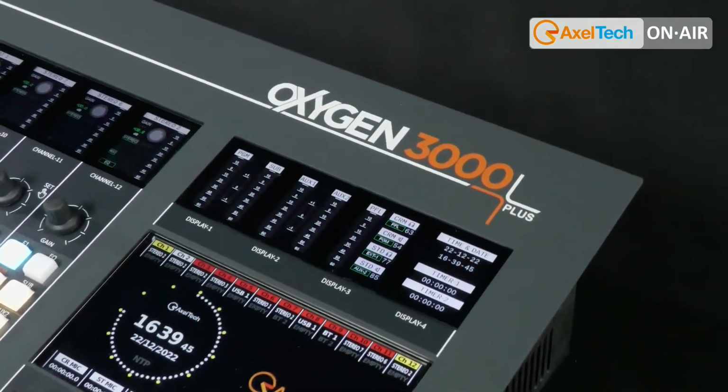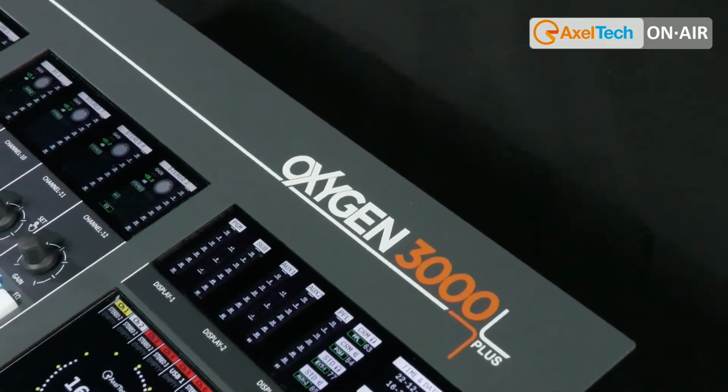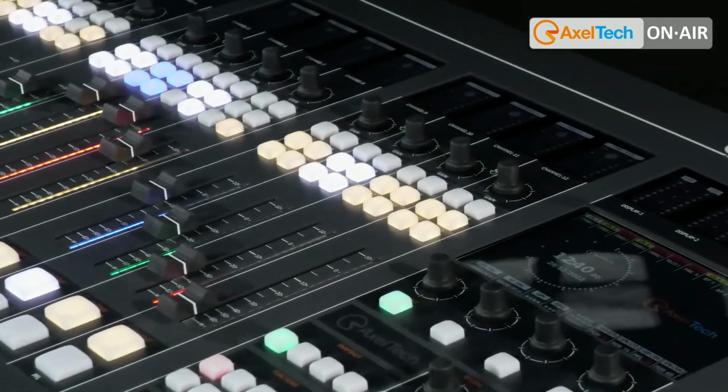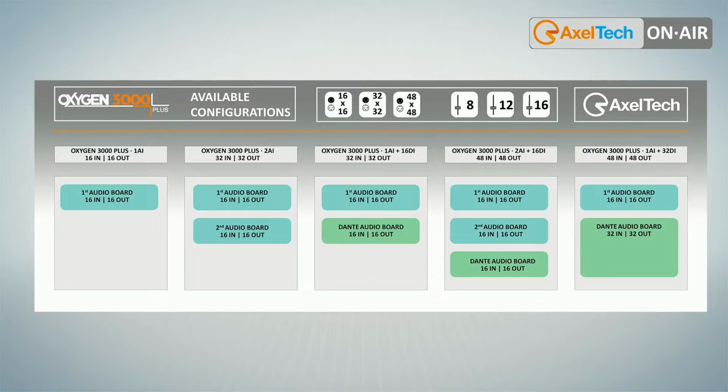Then one of the major advantages is the Dante interface. Now there are two different boards that can be installed, with 16 or 32 faders, input and output channels. Compared to what we had before, it's much more. One of the cards in the modularity of the console can be one audio input board and one Dante with 16 or 32 I/O. This is really a game changer, and it makes the console as if it was a real IP console. So I would say this is another very important development.